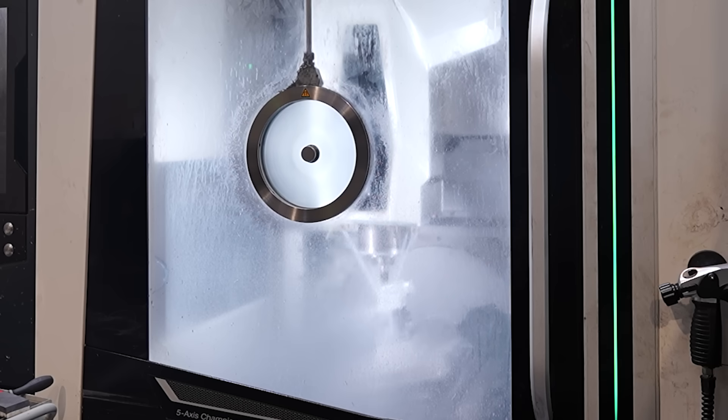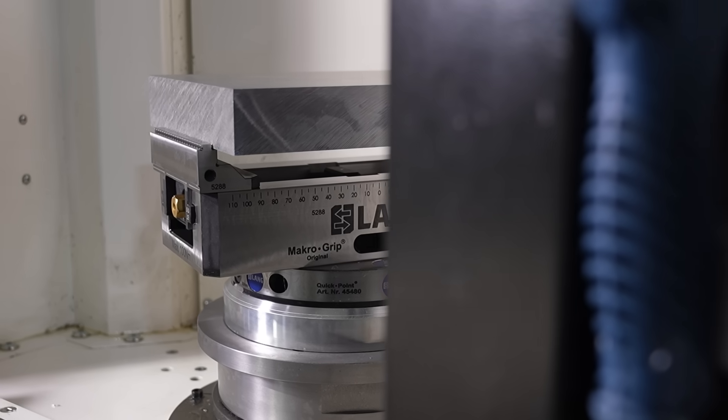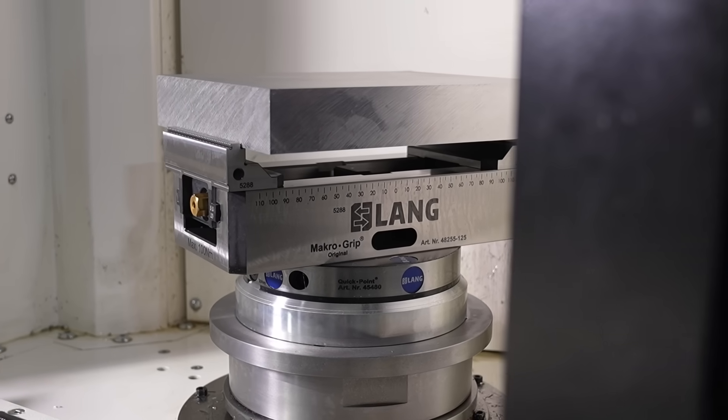What the stamper does is put all the force into the material and allow the teeth on the vice to go into a pre-existing form. The teeth on the vice jaws are actually fractionally higher than on the stamper, because the teeth are like a four-sided pyramid. It's the top face of that pyramid that engages with the material first, which actually lifts the weight of the material off the parallels of the vice. Most people are tapping stuff down with a hammer — our system lifts it up, holding it in a free state, which deadens vibration even when machining very large billets.